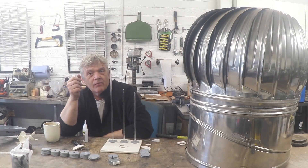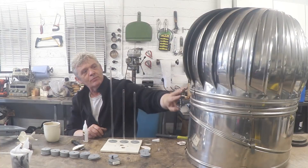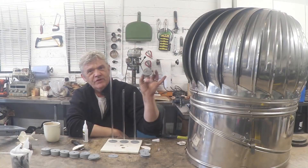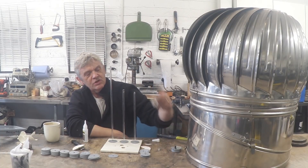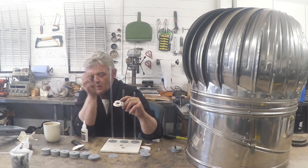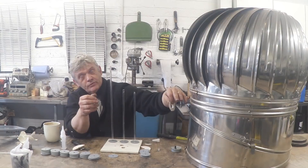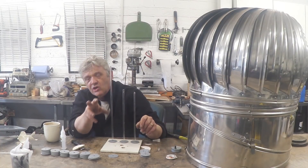That's why we did the motor test on the exercise bike — when you turn at the center of a shaft you have a much lower speed than at the edge, and I wanted to see what would happen. It was mightily impressive. We used the internals of this synchronous motor meant for the turntable of a microwave oven. When you crack it open you get a coil — basically a coil of hair-thin wire that's relatively flat and quite open — and that gave us the good result.